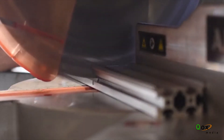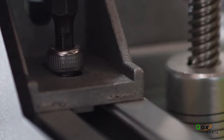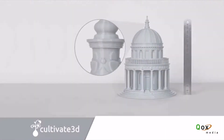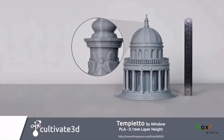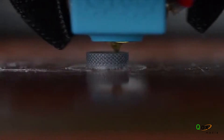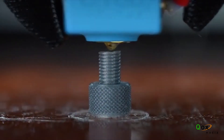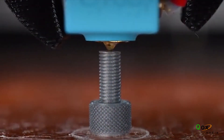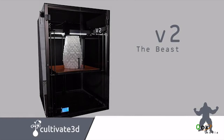It's also built from readily available off-the-shelf components, meaning you can modify the printer to suit your specific application, and replacement or expansion parts can always be sourced quickly and cheaply. Size matters, but that's not all this printer is about. With layer heights ranging from 0.01 millimeters to 0.8 millimeters and nozzle sizes from 0.15 millimeters to 1.2 millimeters, our printer offers almost infinite flexibility, especially with regards to precision and speed — all for less than half the price of comparable machines.